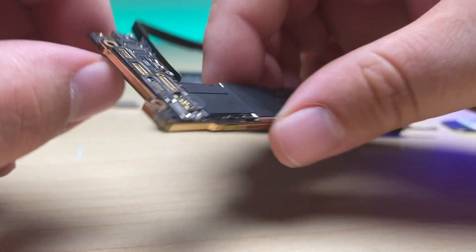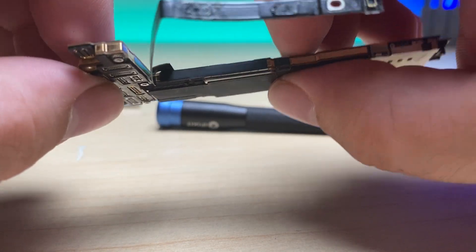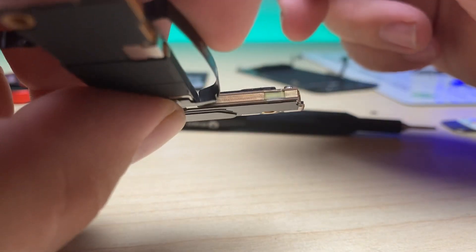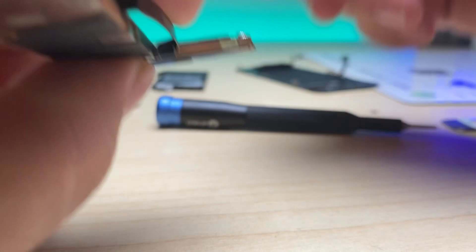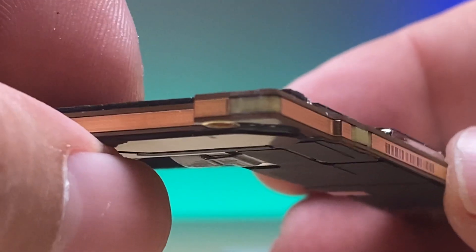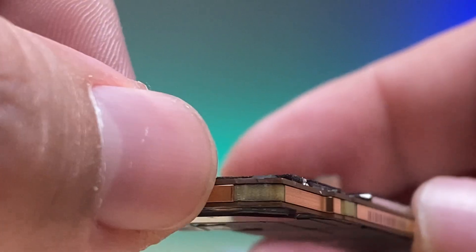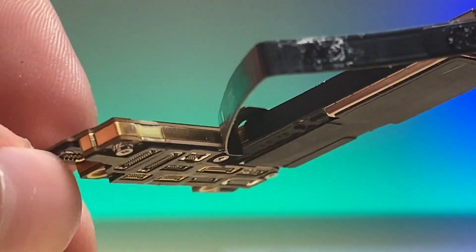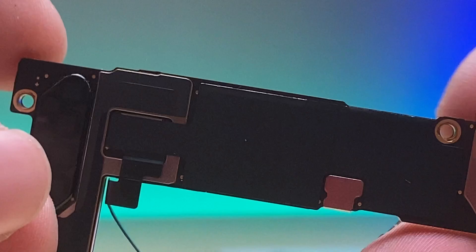The corrosion at the top probably got in between the board layers. And over here — there's some more right here. Here's a better shot: it's definitely corroded on the top there. We might have some corrosion that's bridging things together within the board layers, and there's likely more on the backside. So I'm really going to have to separate these boards to make this work.